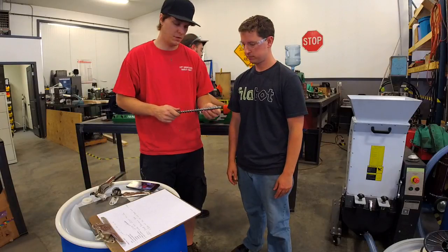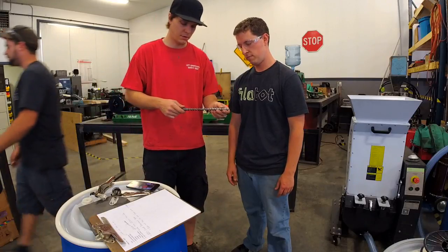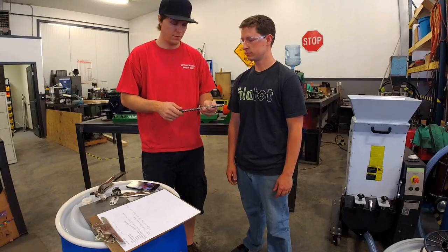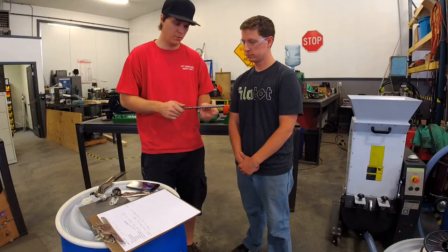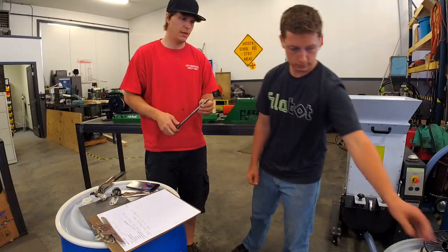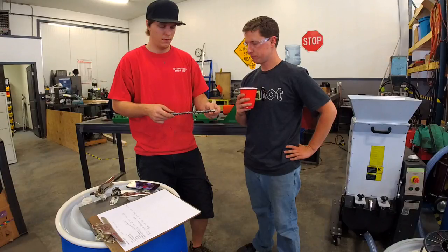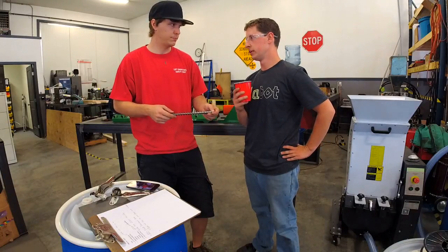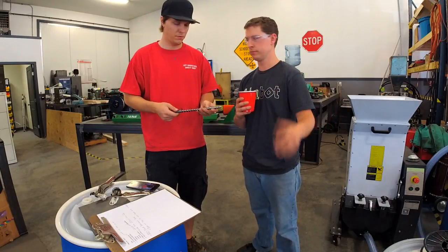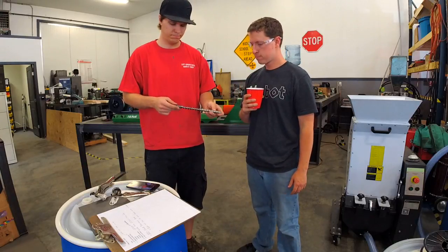So we've come up with this design mainly through testing. A lot of testing. It works pretty well for most plastics in general, but there are some issues with it. Some polymers don't do as well because they work better with different compressions, different pitches, different designs to the screw. This one works great with PLA and ABS, which are higher shear rate, lower melt flow polymers. Compared to a PET, PET is very viscous when it's melted, so it doesn't work as well with the screw. It's designed to be blow molded. So we're working on designs that work well with other polymers as well.